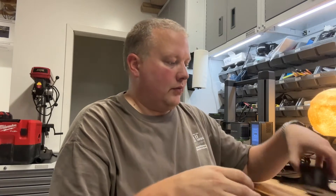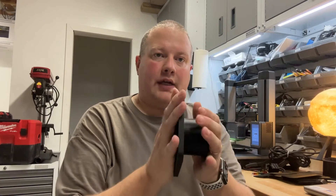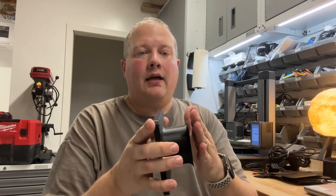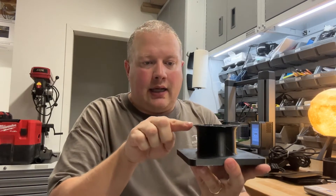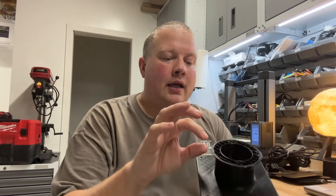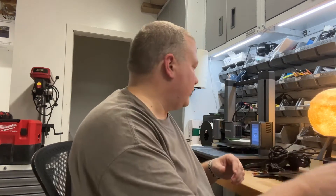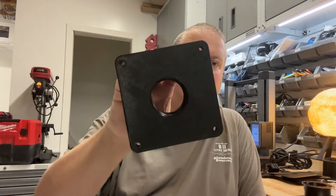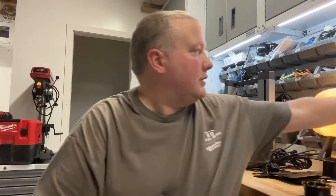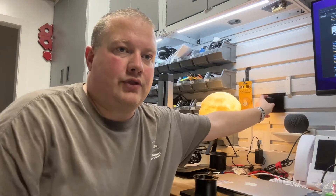My original thought was to build the mount out of one piece — the mounting bracket on one side and the base that attaches to the monitor on the other. It works great to attach, but I did a poor design. It prints like this, and there was a flat surface meant for the bracket on the gear wall, but I didn't design the model right so there was nothing to support the print. So I decided to do a two-part print. Part one is the VESA mount, and it's threaded. Part two is the part that actually attaches to the wall, and this part would screw onto that with the monitor attached to the other.